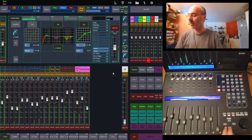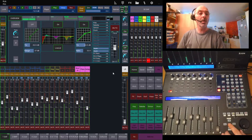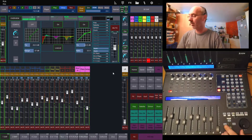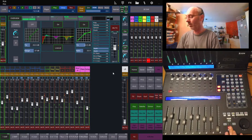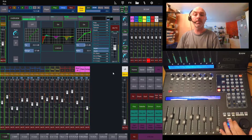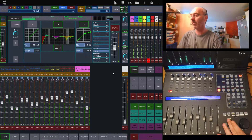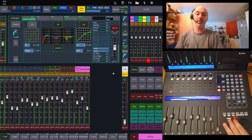Moving between the channels on one layer — in the middle the zoom button, you might see it blinking, controls the tap delay, the time of my delay by tapping. You can go slow or fast, whatever I need. The button down here activates mute group one, which is always my FX returns. And that one solos my active bus — my active master can be FOH or a monitor send, so I have it on my headphones.